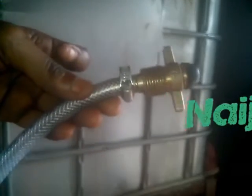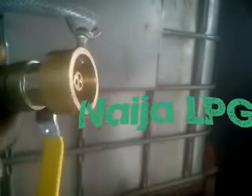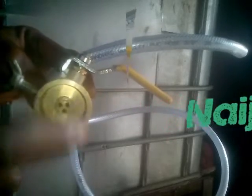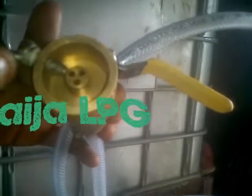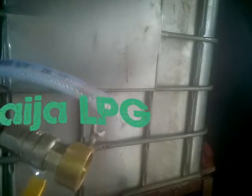One end of the pigtail hose pipe is attached to the empty gas cylinder and the other end to the full tank. Open the valves. Here is a transfer kit for a 12.5 kilograms empty gas cylinder — this is a screw mechanism. Carefully open the valve on the full tank and then the valve on the empty gas cylinder. Gas will start flowing and the digital scale will give you a real-time measurement. When the hose pipe has been correctly fitted on the valve, the outlet pressure and flow can be increased by turning the valve in the direction indicated by the arrow on the label of the hand wheel. The gas flow can be stopped by turning the hand wheel until stopped — in this position the valve is closed.